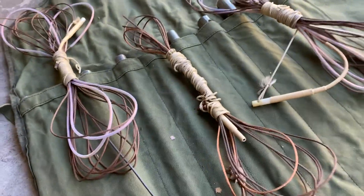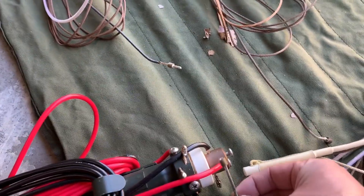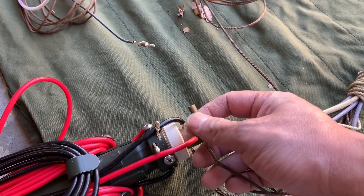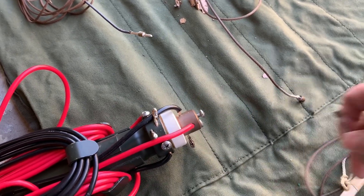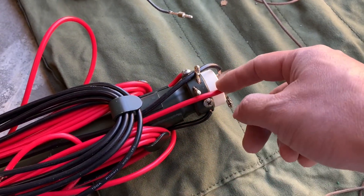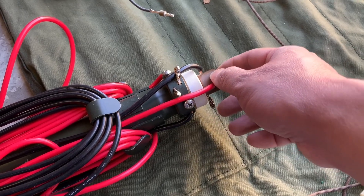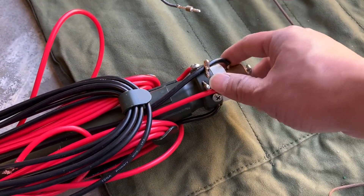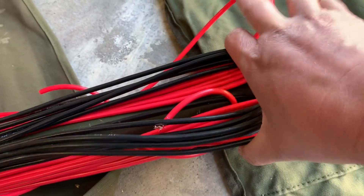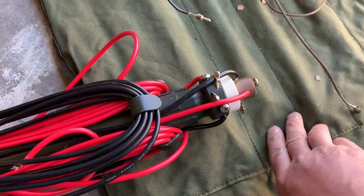Originally the wire is attached to the top in this way. The wire goes through the hole here, and this is the cap. The cap is soldered to the wire. So I heat it up, remove the solder, and put the new wire in. This wire is 10 gauge. The diameter is a little bit smaller than 3/32 inch, but very close. With the plastic skin it's become pretty fat. Next step is to adjust the length of this wire to make it work at 40 meter and 20 meter band.